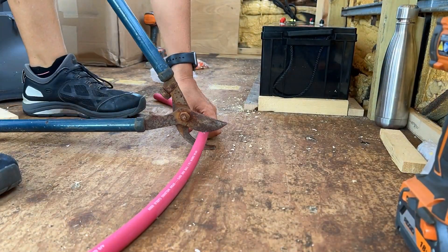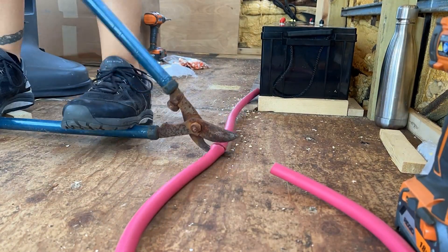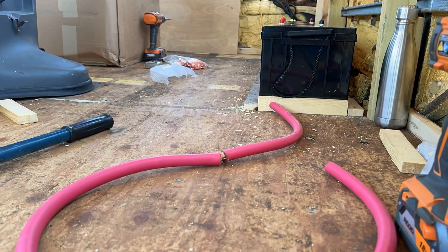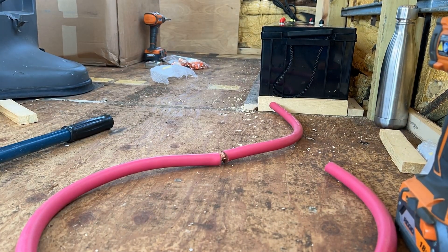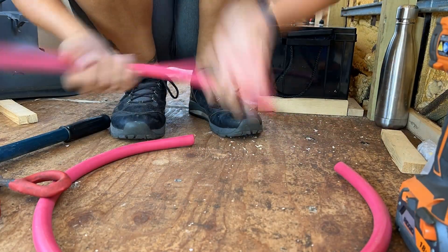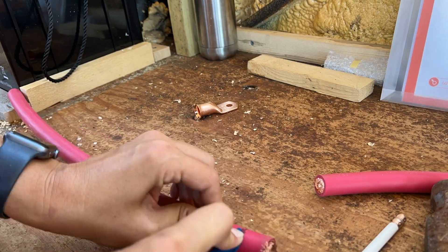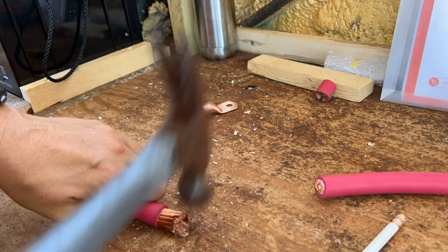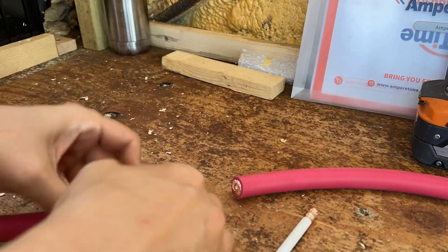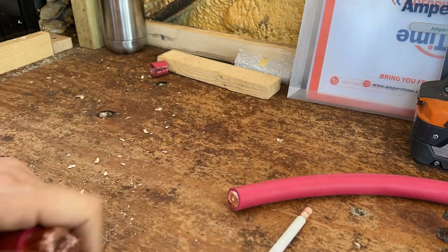Then I got to cutting some of these really large wires. First thing I tried to use was this pair of large garden shears, and not only did it take a million passes to get through, but it left a really rough edge and frayed some of the wires. I had to finish up with some hand shears here. This is not the way to do this, but I did not have the right tool at the time. As a result of the fraying, I wound up having to actually put the jacket back on the wire and smash it back into shape with a hammer so that it could fit into the wire lugs that I was using.